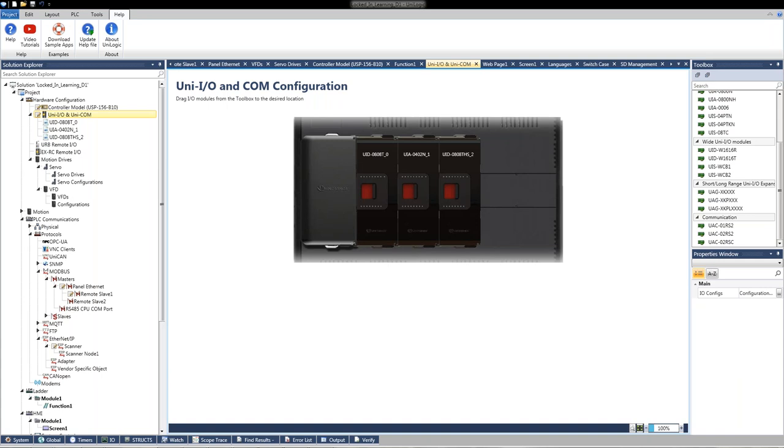What about the internal time and time update connection to the time server? Yeah, so you can use a time server in the ladder. You can connect to a time server to update the time according to what you're working with. Generally, it's not needed. The PLC can have its time set to match the PC right when you're downloading. And with that kind of setup, it's going to be what your current computer time is. But absolutely, if you have an internet time server that you want to utilize, you can do that.